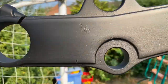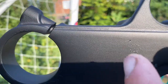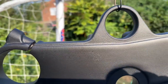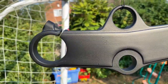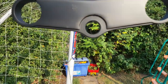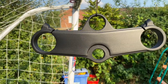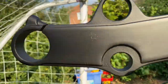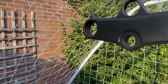What I'm going to do is let it dry for about 24 hours — probably come back to it tomorrow — and that bit that I've roughed up a little bit I'm going to lightly sand over and then give it another two coats before I put two coats of clear acrylic lacquer top coat on. I'm not sure how it's going to turn out; it looks okay, it's not fantastic, but we'll see how the final product looks.